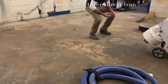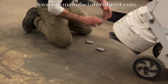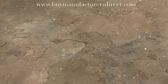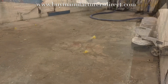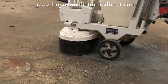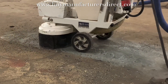The demo starts by putting triple-PCDs on the two-head rotary machine. These tools are made to remove bulk coatings that are too difficult to remove by diamond segment. This particular floor is covered in paint overspray and other materials that have been spilled on the floor, what appears to be over a course of years. The triple-PCD is made to remove the bulk of the material quickly, though it doesn't actually grind the concrete — it is able to chip away at that topical material.